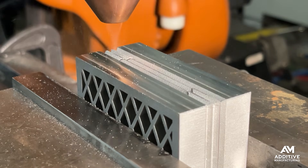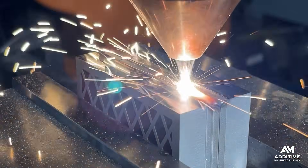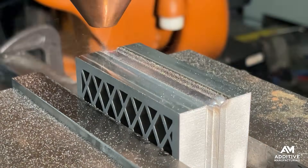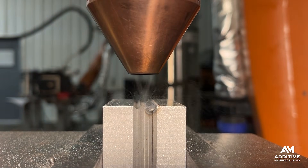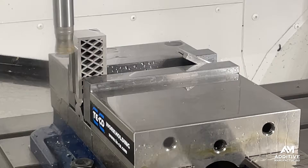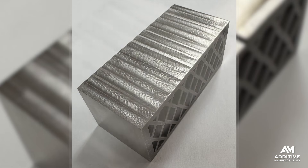The next step is metallurgical bonding. Laser cladding is used to fully enclose the joint and join the pieces together permanently. This step is performed by Synergy Additive Manufacturing, a sister company specializing in laser directed energy deposition (DED). Synergy Additive has developed its own DED platform using fiber lasers, robots from KUKA and FANUC, and a Fraunhofer material deposition nozzle. In this case, the test piece was clad using 316 stainless steel. Finally, the parts are finish-machined and polished to their final surface finish, and the joined parts should look and behave as if they are one solid piece of metal.